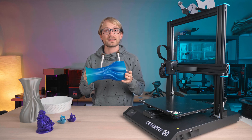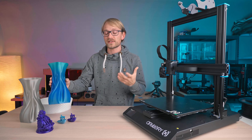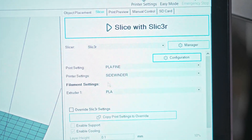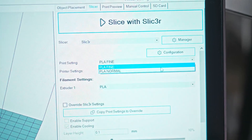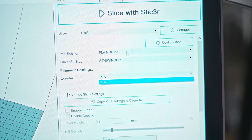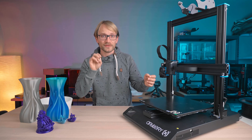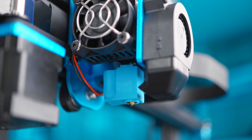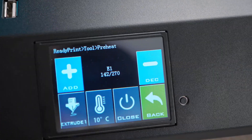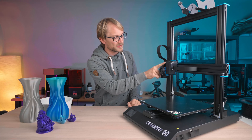For this vase, I think it took like 15 or 20 minutes just to slice versus seconds when using the same setup on PrusaSlicer or a modern version of Cura. The X1 comes with two profiles, PLA Normal and PLA Fine, and they're actually well-tuned and work great with the X1 hardware. There are no profiles for PETG or any other materials included, and with this improved hotend the printer caps out at around 240 or at most 250 degrees Celsius before the PTFE starts to get damaged.